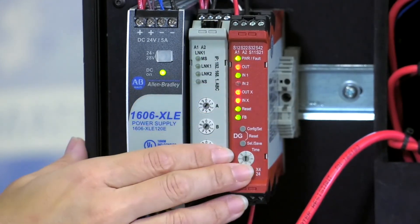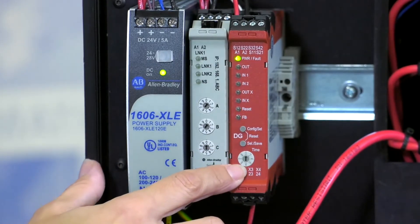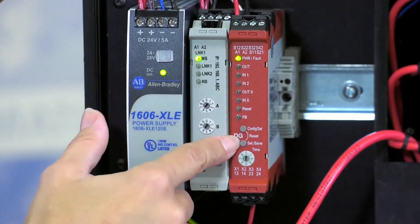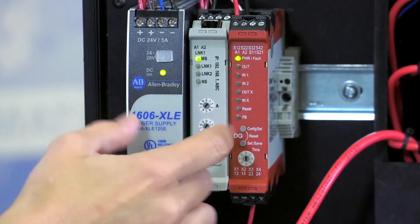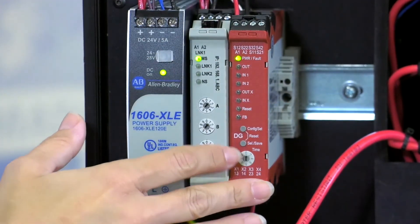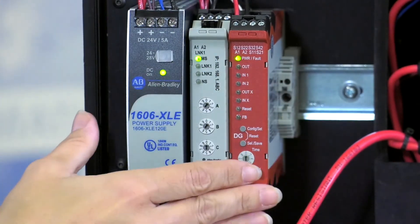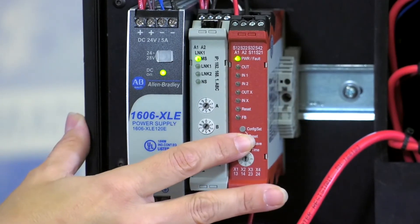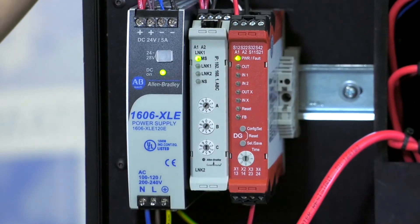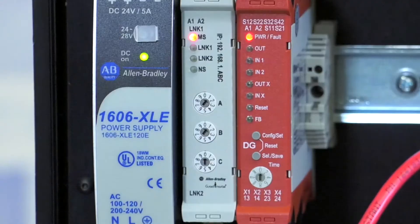We're going to hit Save Select one more time to go to the next step, which is your timer. Since it's on zero, nothing's flashing. Had I had it set to a different time, it would flash the bottom three LEDs the amount of time — so if it was four seconds, it would flash four LEDs, wait four seconds, and then flash those four again. This is what I want — I want it at zero. So we're going to go ahead and save it, hold it down for a second, it's going to flash at us, and now it's going to do a power cycle. And once it's all done, it's all set to go.